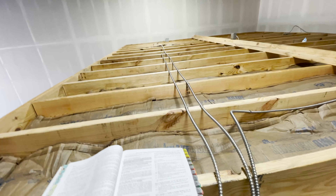So in all reality I don't even need to put these staples on here — it is being supported across these framing members at intervals of 16 inches, not even six feet. If it were more than six feet between each truss then yeah I'd have to secure to make sure it's within every six feet, but it's not. I just like to do it because I'm going to keep working up here and I don't want to be tripping over cables or crushing them. In this installation you don't have to staple — it clearly says supporting at these specific intervals covers it as both supported and secured.